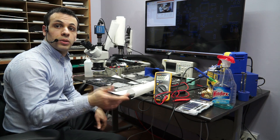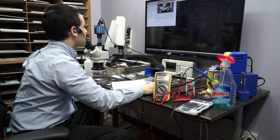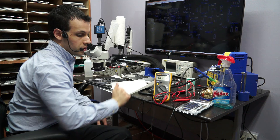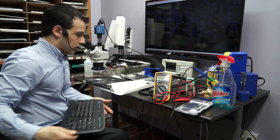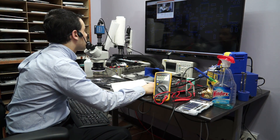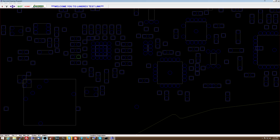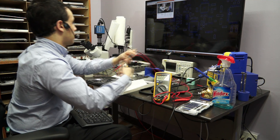If the fuse were blown, you would not have 17 volts on output, or 12, or anything. The fact that it's 17 volts is the lowest amount it would reach while boosting is occurring. So we're going to make sure everything measures the way it's supposed to. The first thing to check on the screen is backlight enable — that has to be three volts. If it's not three volts, we won't get what we need.